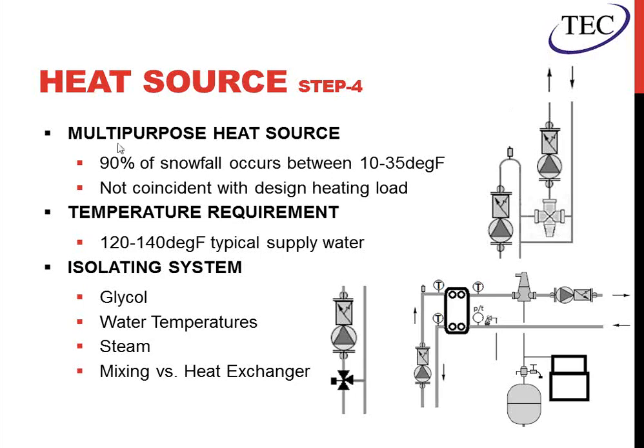For a larger thermal mass, if the square area and slab thickness are much larger, your pickup load is going to be quite a bit larger than your melting load. You may oversize your heat source and circulation to account for this so that the pickup time is shorter depending on the application. Usually if an application needs a quick pickup time, you'll consider keeping the slab at an elevated temperature in an idling mode, as we'll discuss later with controls, so it can offset the pickup load and you won't have to oversize the heat source by as much.